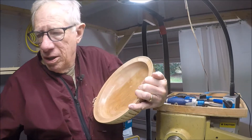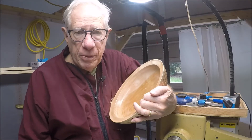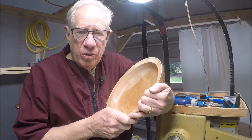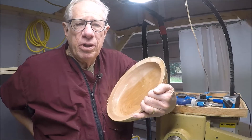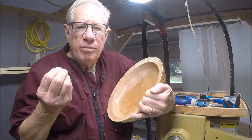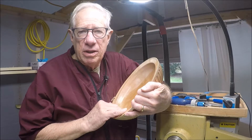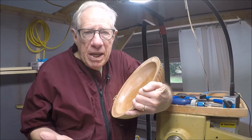Some folks like to use a pumice of some type — there's a three-stage pumice, like number four, number two, and then a thing called a rotten stone. You can use those with a cloth to smooth out your surface, and that seems to be pretty good. A friend of mine makes a combination of beeswax plus pumice plus some mineral oil. He puts that on the bowl, turns the lathe on it, spins it, and gets a good surface on it.